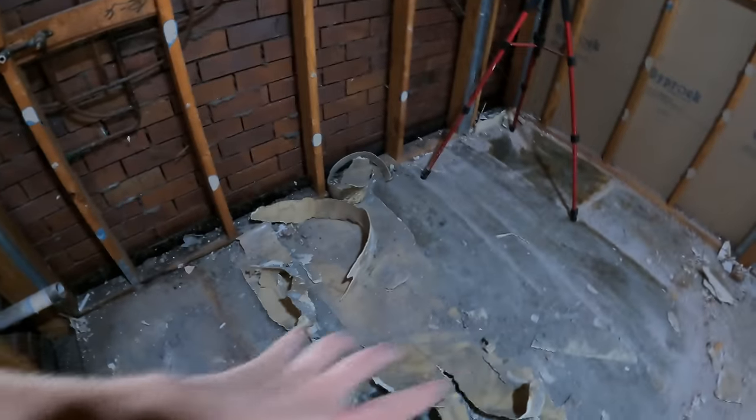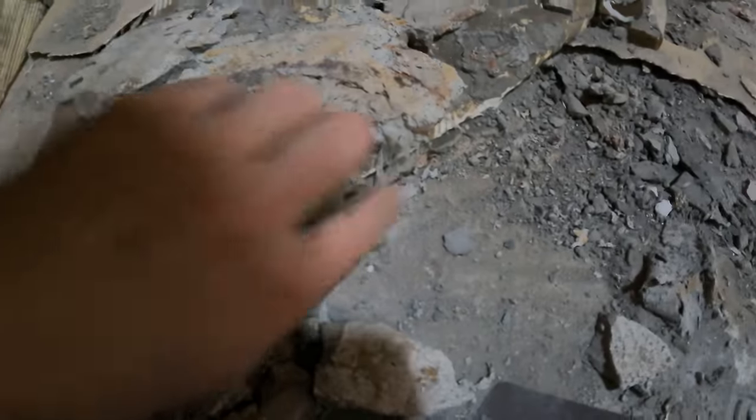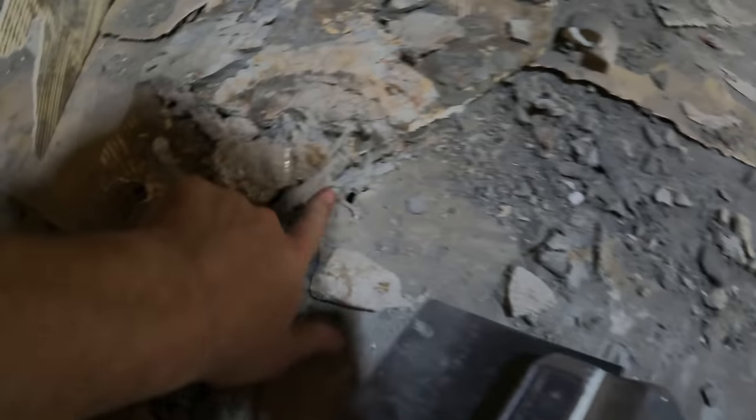I was chiselling in here — this was originally the laundry — and there is no drain. Found it under here: looks like they've bagged it up, poured concrete around it so the concrete wouldn't go down there, and then just vinyled over it. I just can't understand why — this was a functional laundry. Strange.